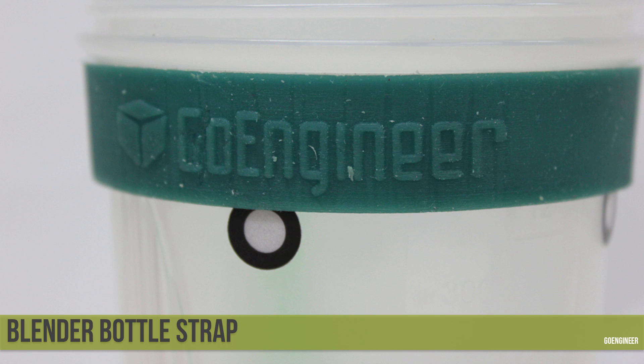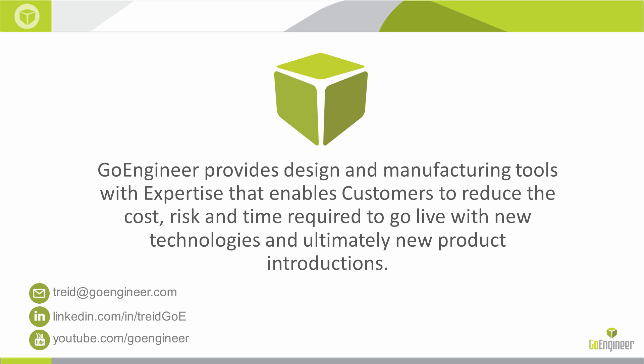Overall I was really happy with how easy this process was. The total time from scanning a part, to creating the geometry inside SolidWorks, printing the mold, and running the parts was less than 36 hours — about a day and a half total. And that's about it for this webinar. It's a short and sweet webinar covering a topic that I think is familiar to a lot of people.